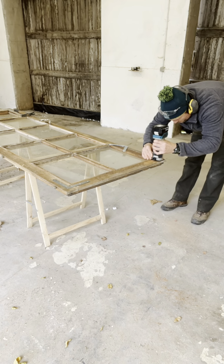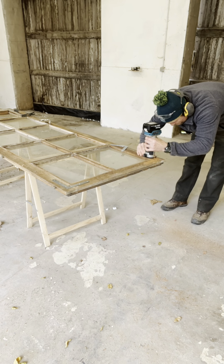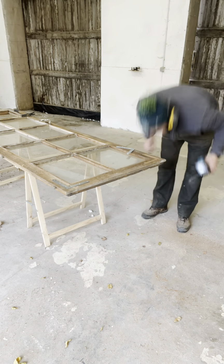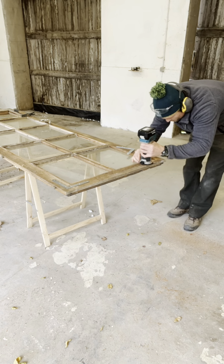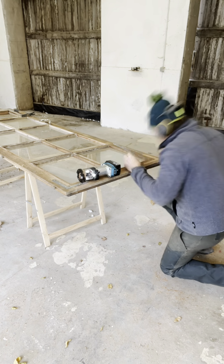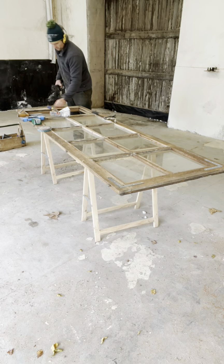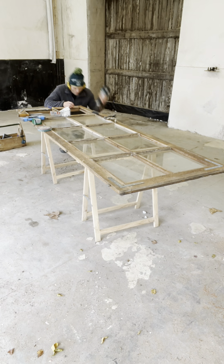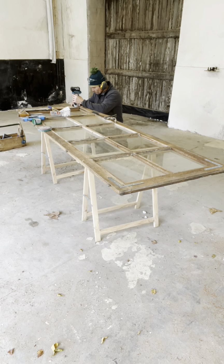So I felt with this job and to square the door up, this was the best option to try and brace the door and secure it in position long term, rather than pulling the whole door apart, because the frame of this door was all made quite well with mortise and tenon joins. So over time, they would obviously degrade, and I didn't really want to play with fire by pulling all that apart and possibly having to do a complete rebuild of the door frame itself.